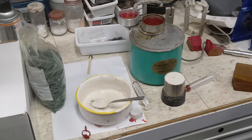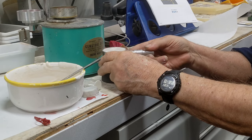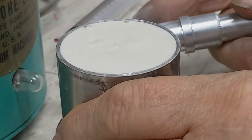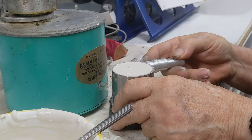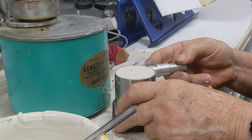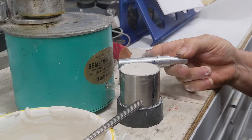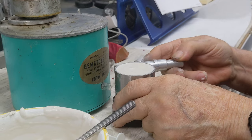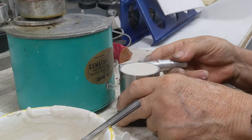Normally if you had a chance, you had a vibrating table as your best bet. See those little bubbles coming up in there? Mainly what we want to do is keep it away from the waxes. What some of them do is make a medium solution, just a little bit thinner, and they would dip the ring or the object in it two or three times and kind of coat it — then put the shell on, then go ahead and pour the investment. So that way the bubbles would be separated.